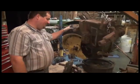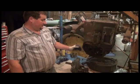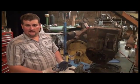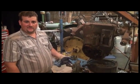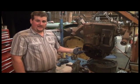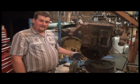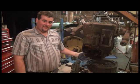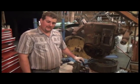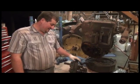But aside from just draining that oil, it's also a good idea, best practice, to replace the plug, put it back. And I recommend you could use kerosene or diesel fuel, something that will act as somewhat of a solvent. Personally, I like kerosene. Put it back in, engage your power shaft, and let the tractor run for 10 minutes. And then drain it before disassembling, and you'll have a much cleaner area to work with in your power shaft clutch. Unless you just really like grease. So we're going to go ahead and, in the next video segment, tear apart the clutch.